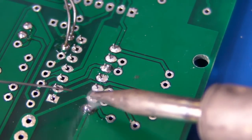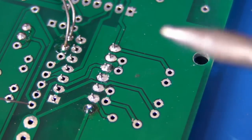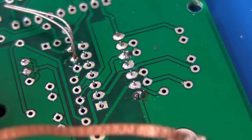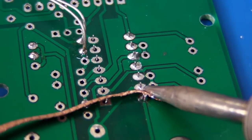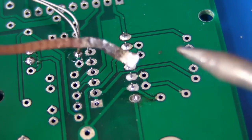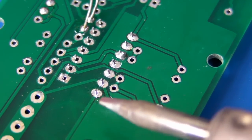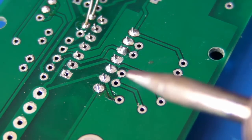Let's apply even more — it's a nice big ball, and these dags of solder come off when you pull the iron away. That is a terrible joint. Now, to fix that, you get some solder wick and apply it over your joint like that and suck some of that solder off. See — it actually wicks right up the solder wick like that. And we're left with a much nicer joint again. So if you do apply too much solder, there's nothing inherently wrong — you can wick it away. That is a very common technique with surface mount components as we'll see.